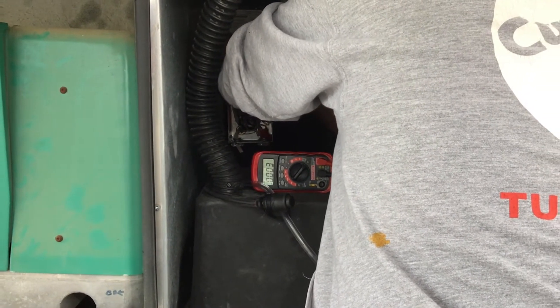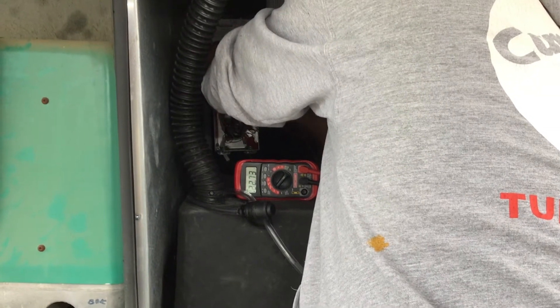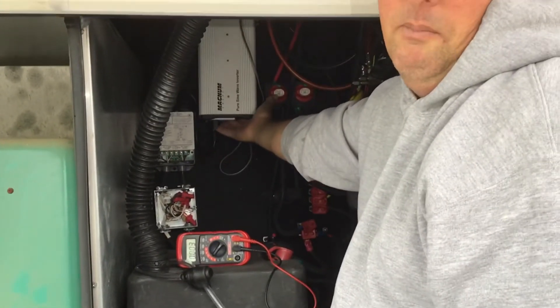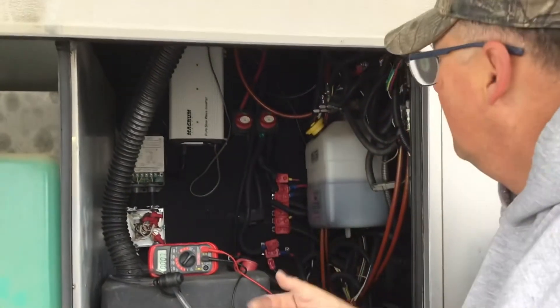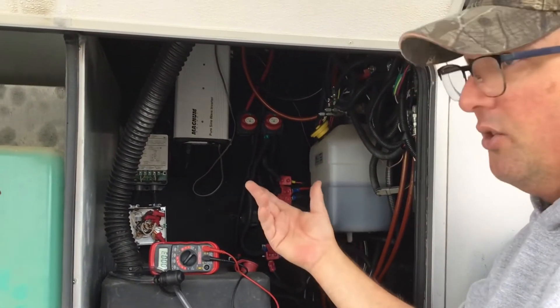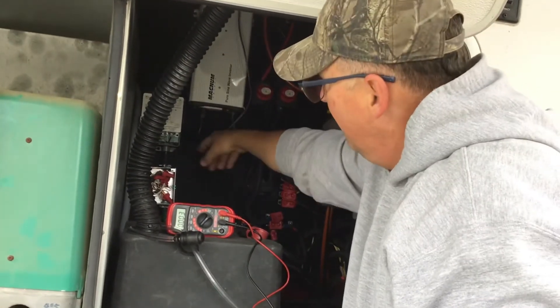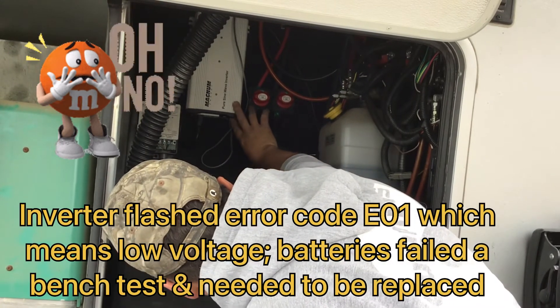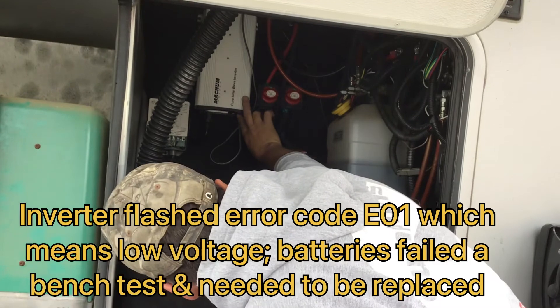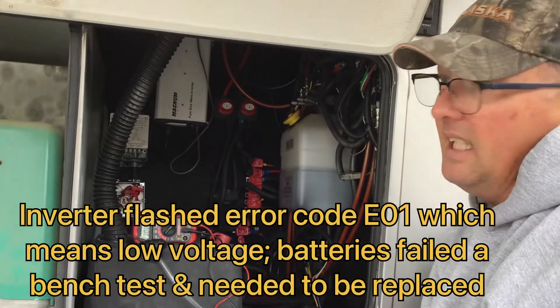Anything? Nothing? That one's all over the place — 119.4 volts. What had happened was as I was working I tripped the GFI outlet on the bottom of the inverter, so I had to reset that. But that's what we wanted to see — we now have power to the refrigerator operating off the batteries. The power comes from the batteries, goes through the switches, hits the inverter switch, and runs to the line. However, I'm seeing something on the inverter that isn't a good sign — it may mean the inverter is not working the way it should.